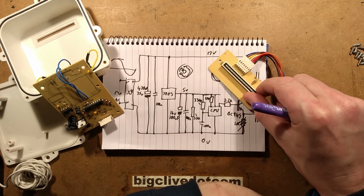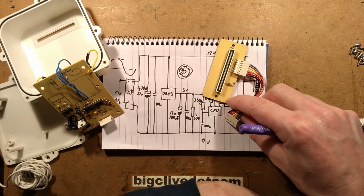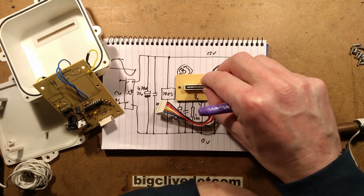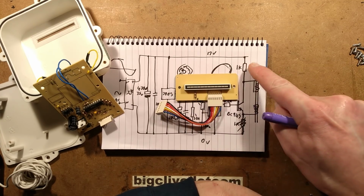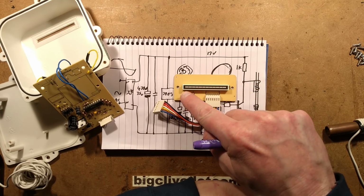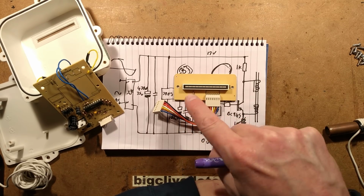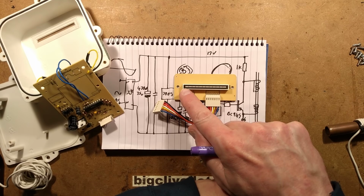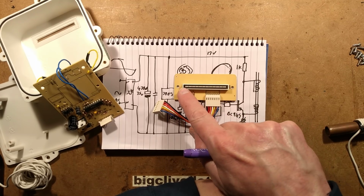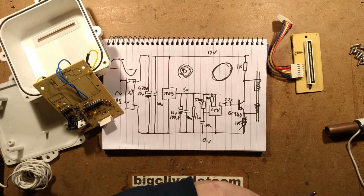There must have been a bit of time trying to work out, because the LEDs are not in order. It must have been a wee bit of effort to actually work that out on paper and write the code to actually get them to run the correct sequence. My guess for the software itself is that it's got a routine that does one frequency sweep on the output. And in the main routine, the software will have 12 steps, basically one for each LED, and it'll light the first LED, and then it'll call the sweep routine X number of times as a delay, then it will put the first LED out, light the second one, then call the sweep routine for X number of times and come back, and that's how it gets that chasing along while it's also doing the swept frequency on the output. So there we have it.